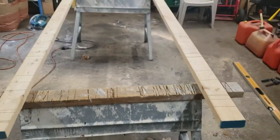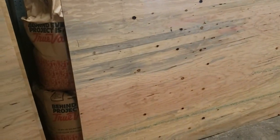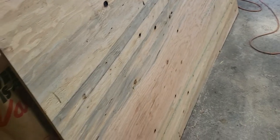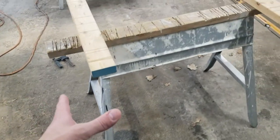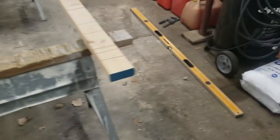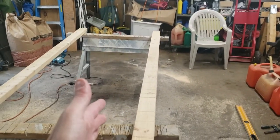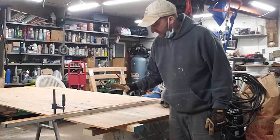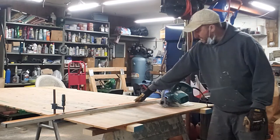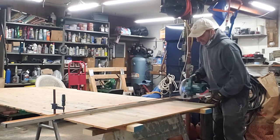Just a super simple way to do that and to get perfect cuts. A lot of times if you're sheathing a house or something you don't need the edges to be perfect, but if you're doing cabinetry or anything like that, it's got to be a nice straight edge. I just use a level as a straight edge. If I'm going the long way I do have an eight-foot straight edge at my shop. I've got the sheet of plywood laying on top of these boards with the level clamped to it so it can't go anywhere — I'll get a perfect cut. Watch it.